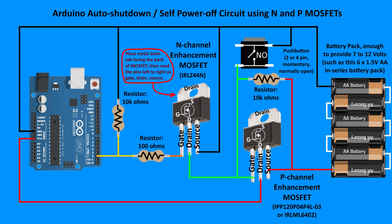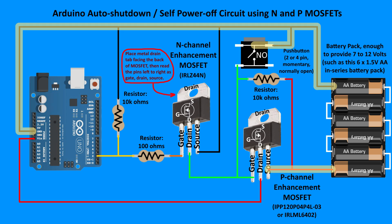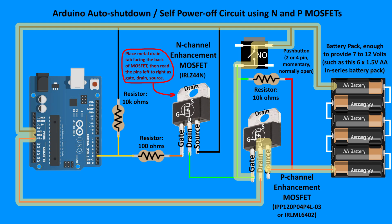Anyways, let's go over how this circuit actually works. It starts with the switch and the Arduino being grounded, as well as the source of the P-channel MOSFET being connected to the positive battery terminal. When you press the button, the gate of the P-channel MOSFET has a pathway to the negative battery terminal. This creates a negative gate voltage compared to the positive source, and in a P-channel MOSFET, this allows the source to flow with the drain. Now the Arduino is receiving a positive charge and is successfully turned on.